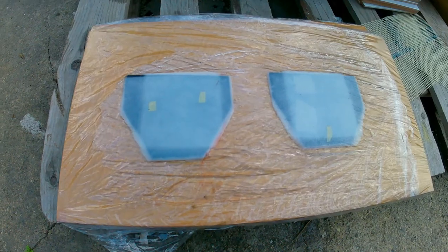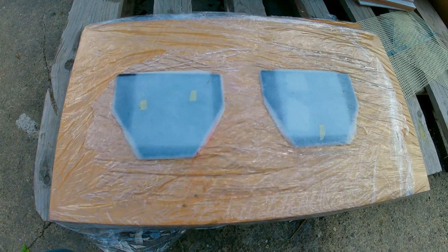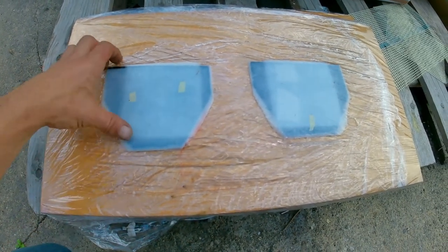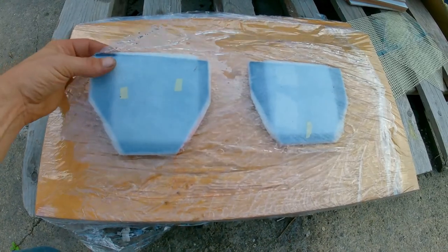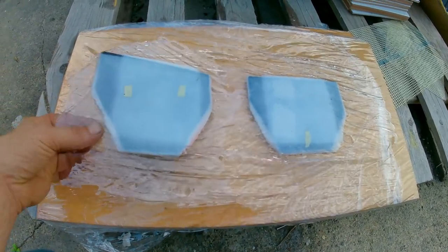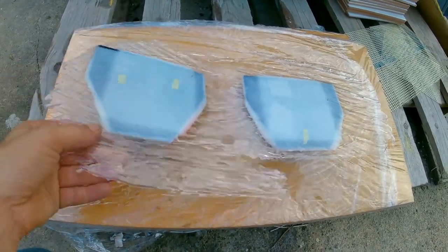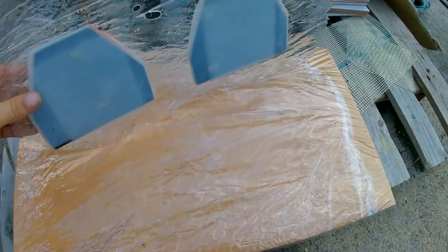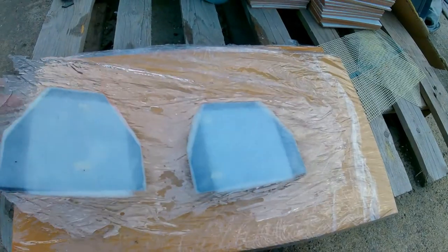3 days later. After the epoxy hardened properly, you can take the plates out of the form. You will notice that the excess epoxy that has been squeezed out of the fiberglass mats will need to go somewhere, so it formed around the plates in the press. I used my bandsaw to cut the excess epoxy off the plates.